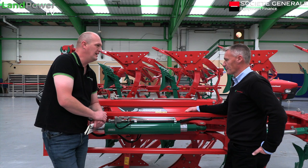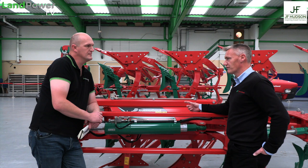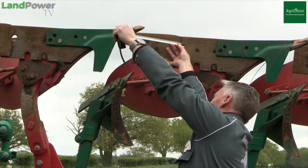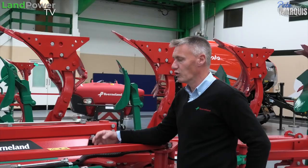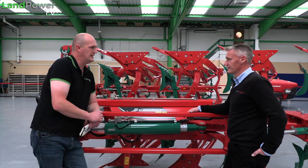Let's talk adjustments - front furrow width, interbody width. Front furrow width, if we're plowing on-land, that's taken care of by the driver or the guidance - no problem. But when we come back to the in-furrow position and adjust our vary width of the plow, it will automatically adjust our front furrow. The plow is available as a hydraulic vary width - which this one is - and we can go anywhere from 12-inch furrows all the way to 20-inch furrows. Or we can have a manual vary width version, where we literally unbolt each individual furrow and change.